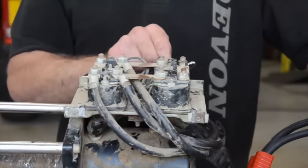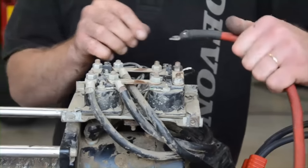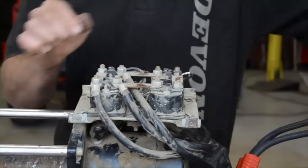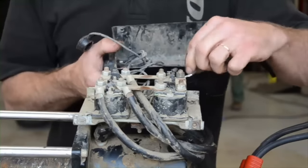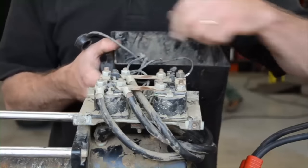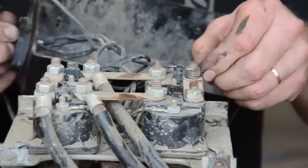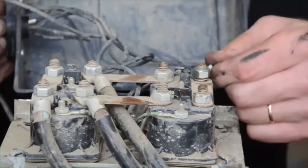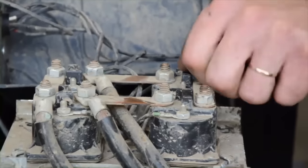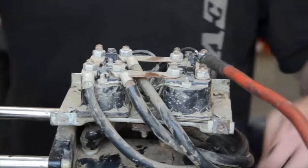The main feed, if it's still on the four-wheel drive, will have the red connection to it. If that isn't there, then generally on most winches there will be the feed for your control lead, and that is the main positive connection. Because this is off the car, there's the main positive connection — it's loose, so that's an indication that it is the positive lead which has been taken off the vehicle.